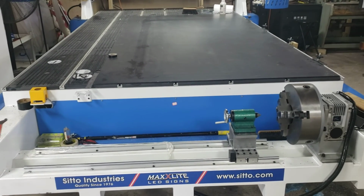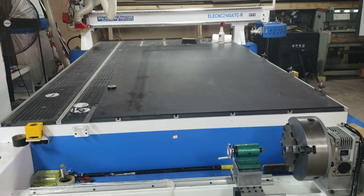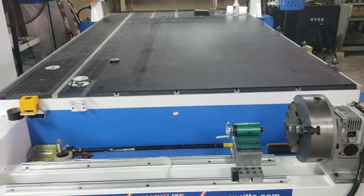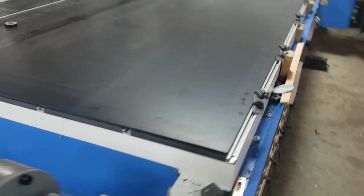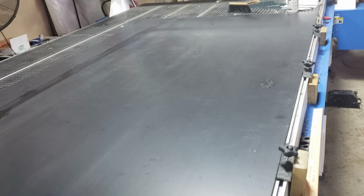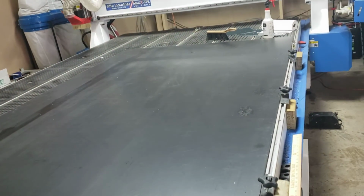Today we're going to cut out a sheet of aluminum, .063 thickness, 4x8 sheet, and I'll just document some of the steps. On our table we have a substrate, a 12 millimeter substrate, basically just a flat piece. Our table is very well precision, so anything we put on here is fairly level. Also, since we're through cutting, it doesn't really matter. We're not trying to get much in the Z direction accuracy because we're going to through cut.